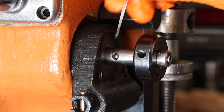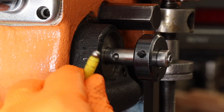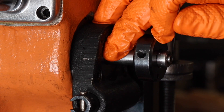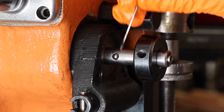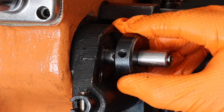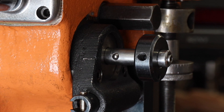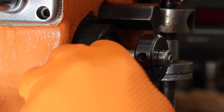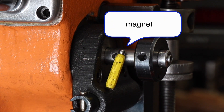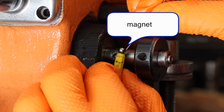This short clip shows the clutch rod and the hand wheel that interfaces with that ball bearing right there, so you can see how the assembly fits together and how that ball bearing blocks the hand wheel clutch from coming off. Apparently gunk and debris, old oil and other contaminants, can get caked up in that hole and prevent that bearing from being able to be pulled out.